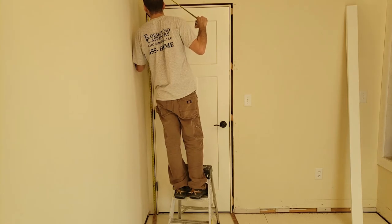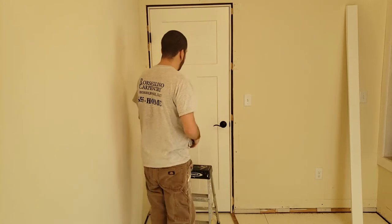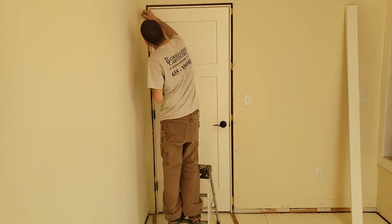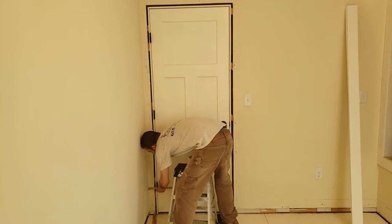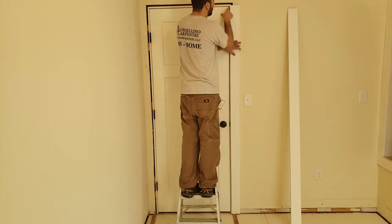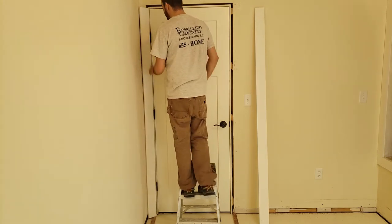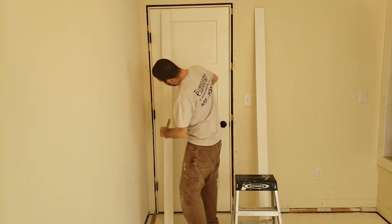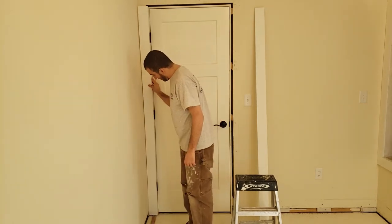This side's a little taller — it's 80 and 15/16 — and then I have to measure the width. I've got about 3 and 1/2, 3 and 3/8, 3 and 7/16. So I'm going to cut those two 1x4s to length, lay them up to make sure I'm on the mark — and then I'll measure over 3 and 1/2 at top, 3 and 3/8 in the middle, and 3 and 7/16 at the bottom. I'm really not taking off that much to get it to fit.